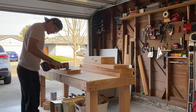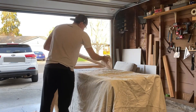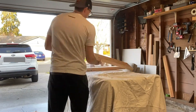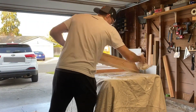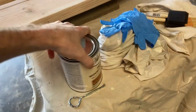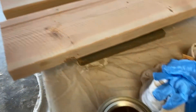I'm going to start sanding down everything, then once done, wipe everything clean of dust with a clean rag for a cleaner surface. The drop cloth is laid down and this is the pre-conditioner that's about to go on — the wood has been sanded and wiped free of dust.